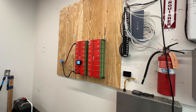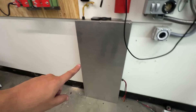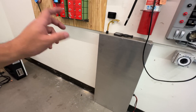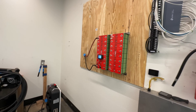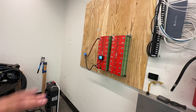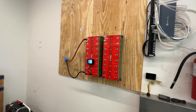A lot of the DIY community has been doing open builds for a long time, and if you can keep things from falling in and shorting out you might get away with it. But I always prefer metal boxes — if a kid or a dog gets near it, they're not going to get electrocuted. Also, depending on where you are, local electrical codes may require all electrical components to be in a sealed metal enclosure. Do your homework and check your local codes.